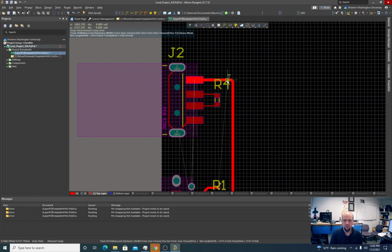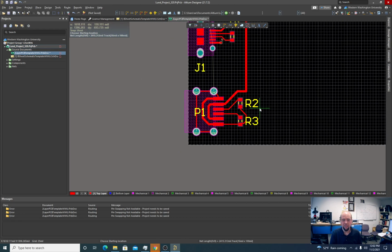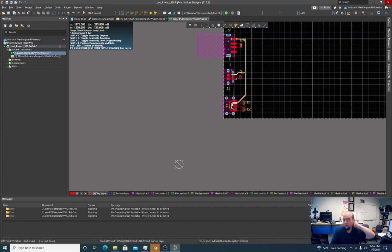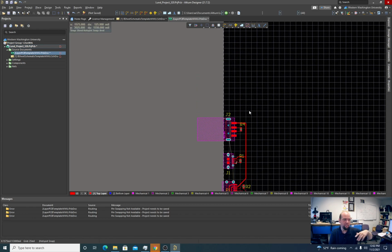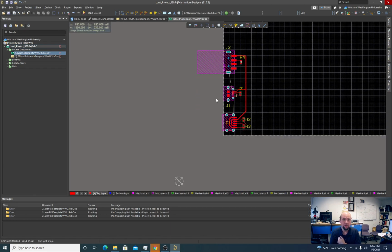You shouldn't actually do this for a design, because if people connect multiple USBs, it's going to short the 5 volts of whatever device they're connected to. And you don't know where each USB is coming from. One could be USB power from a laptop that's just floating voltage. One could be from a wall wart, which is grounded to earth ground. One could be from a different power supply that's floating between earth ground and 120 volts. There are a lot of different ways to generate the 5 volts of USB, a lot of different sources. Some are connected to earth ground, some are not. So connecting multiple devices, power and ground, when we don't know what they are, can be really dangerous. In this case, we would never want to connect two at the same time.